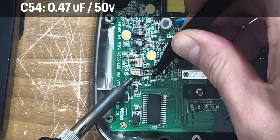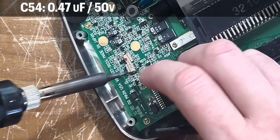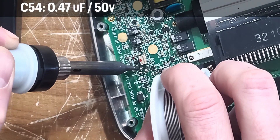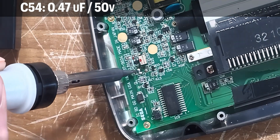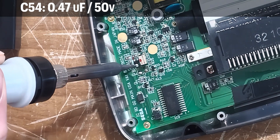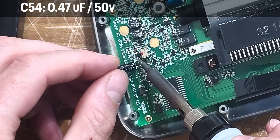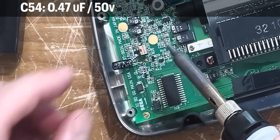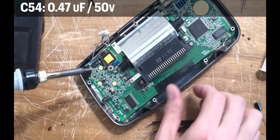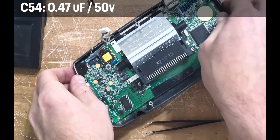Our first repair will be done to capacitor C54. If you look closely, you can see it's stamped to the left of the cap. If the capacitor doesn't seem to budge, make sure the soldering iron tip isn't oxidized or use some flux on the old legs. It looks like the ground pad for this capacitor disintegrated on us. Fortunately, I've had this same pad removed in a prior repair and know the transistor above it completes the circuit. If a pad breaks on you, you can use a fiberglass pen on those white lines to uncover the copper trace, or use a voltmeter to test for continuity. The real strategy here is to tack one leg in place and then use tweezers to bend the second leg where it needs to go.